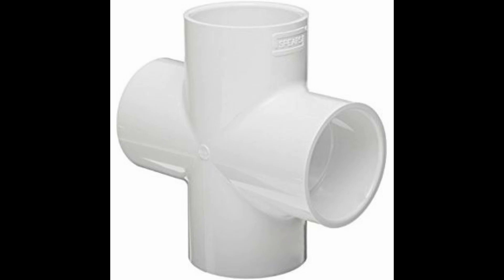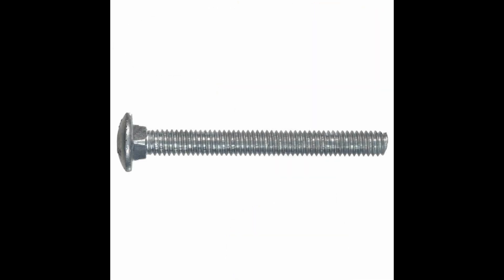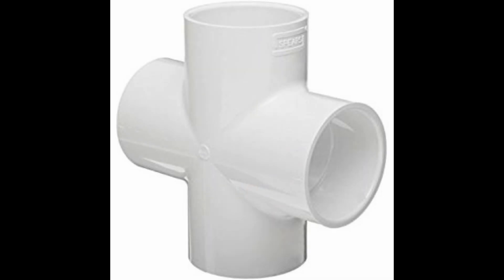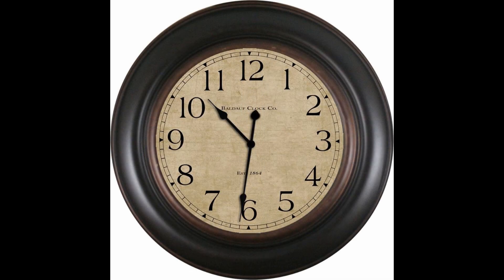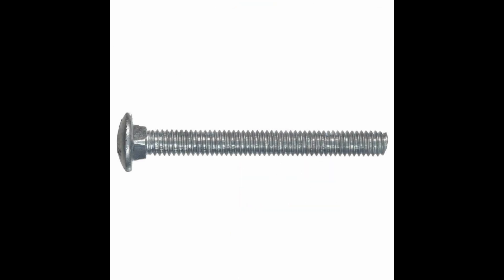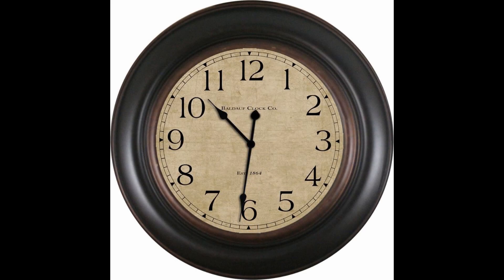If you try to attach the plumbing joints to the struts with nuts and bolts, then for every dome connection you will need to use a power drill to make a hole through the plumbing joint and the PVC strut, then slip the bolt through the hole, attach the nut, then tighten with a wrench and a screwdriver, and to correctly seat the PVC pipe into the plumbing joint, you will need a small hammer or mallet to tap the strut into the plumbing joint. All of these steps take time, and if it takes you only one minute per connection, that adds up to several hours of construction time.